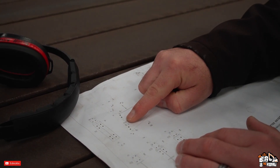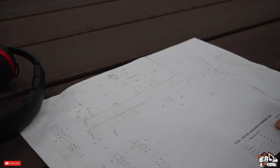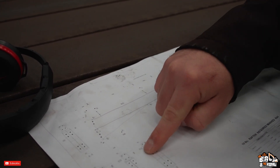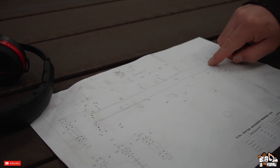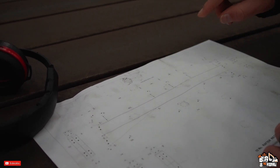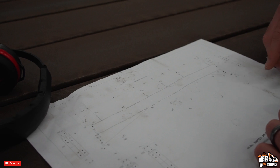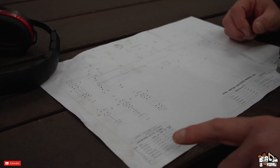These here are the haunches and these are the end plates — you've seen the plates being made in an earlier video. Each weld is noted on the drawing. All holes to be 22mm, so we know the holes in the plate are going to be 22mm, which we'll check before we weld it on. All welds to be a 6mm fillet weld unless noted otherwise — and the noted exceptions are an 8mm fillet weld at the top and 8mm at the bottom. Same again on the haunch: 8mm fillet welds. But all the cleats are a 6mm fillet weld. You've also got your assembly list in the corner.